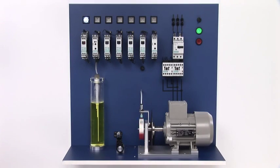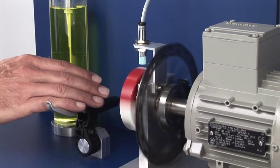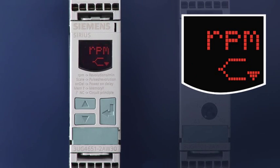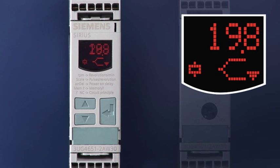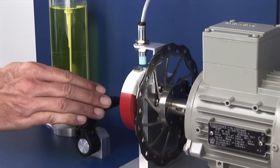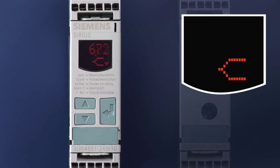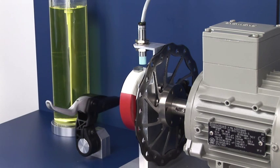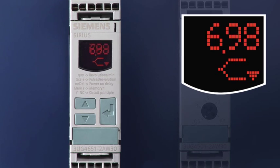This layout illustrates underspeed caused by motor braking. When the speed dips below the set speed limit, the relay symbol on the display starts to flash and the underspeed symbol is indicated. The output relay only switches after expiration of the set release delay time to stop the motor. The currently measured value flashes.